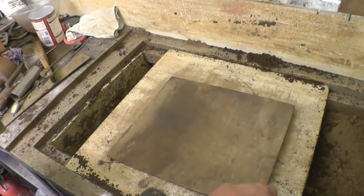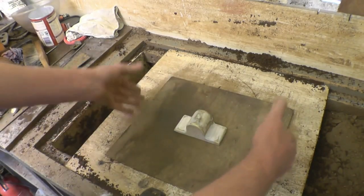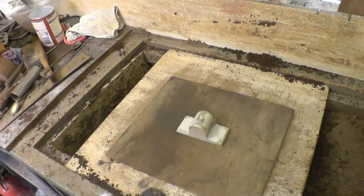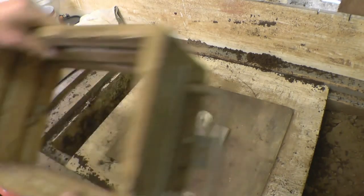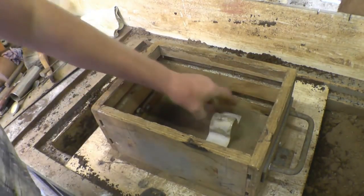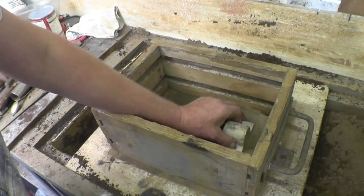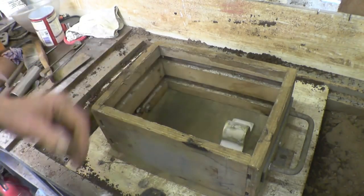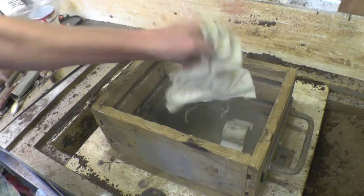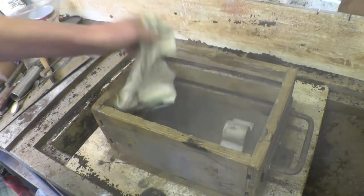I want to put a board down there, the box goes on there. The reason for the board is that when I pick up the sandbox the box is filled with sand and that'll fall out — but with the board on we can pick it up by the sides. The box is a little bit big but it's better too big than too little — there's plenty of room to play with gating and whatnot. Next thing we need to put in is some releasing powder — parting sand — this just stops the sand from sticking to the pattern and from sticking to the other half of the box when we come to ram it up.